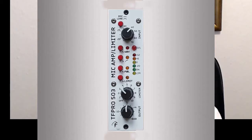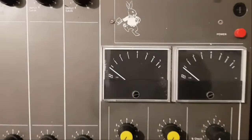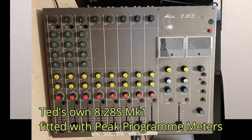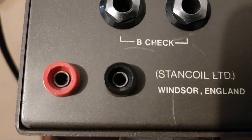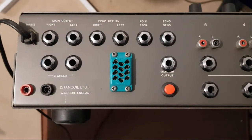The limiter survives today in the 500 series mic amps I've designed. We fitted SIFAM VU meters on the 828, with the option of our own version of the BBC Peak Programme Meter for BBC engineers who preferred to work with PPMs. The terminations were mainly standard jack rather than less reliable DIN connectors, which would keep falling out. Many clients demanded additional features like backup fader switching for monitor muting or machine starting, and of course phantom power. The internal power supply used a special low-radiation toroidal mains transformer, but we also provided sockets on the back panel so the mixer could operate from a camera battery pack, which was really useful for outside broadcasts.